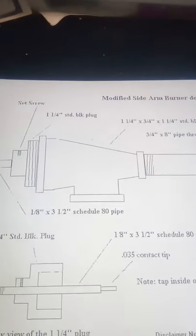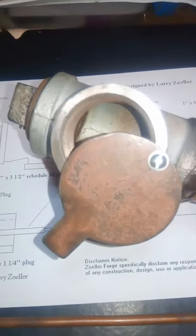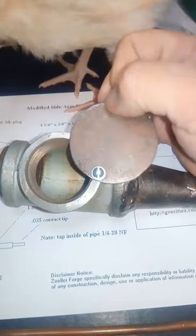It's always best if the hot parts are not galvanized — you don't want metal fume fever. There's a standard bit of trailer mudguard made into a cone for a venturi, because I couldn't find a fitting like Larry suggests. Another bit of trailer mudguard is used as a choke for your air, so you can restrict airflow and get your burner to burn lean, rich, or neutral.